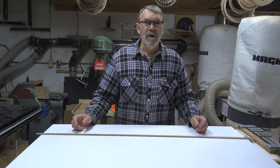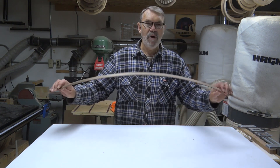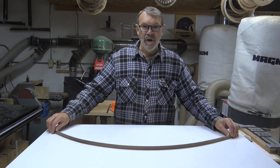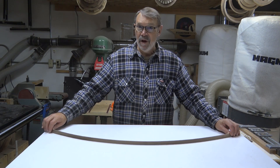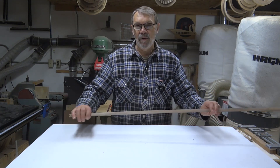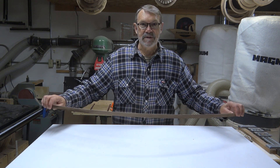If you want to make a large arc with a certain radius, you need to have something to make that arc with, and a drawing bow is for that purpose. If you make this at a certain radius and want to hold it down, you could clamp both ends down, draw your arc, let it go and carry on. But if you want to do it more than once and want some matching curves, then you need a way to keep this arc the way it is. And that's what a drawing bow is all about.